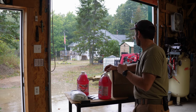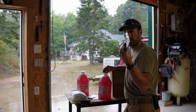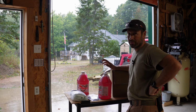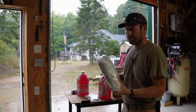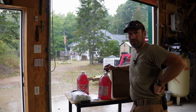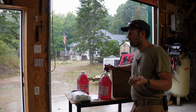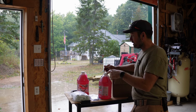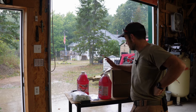So this time, I didn't even check the flapper valves, damper valves, so I'll check those this time. I can't imagine they're bad. Honestly, I probably don't even need to replace the door seal, but I'm probably gonna anyway. Draining it is gonna take a little while, but I got a mag filter on the back of it as well, so we'll take a look at that thing. While we're draining it, we'll check out the flapper valves. I'll go ahead and swap out the door seals, and then it's just a matter of refilling it. So let's get after it.